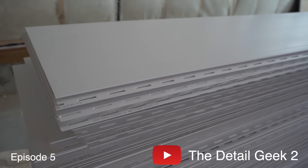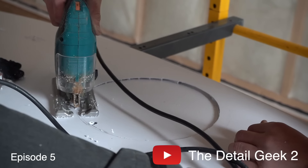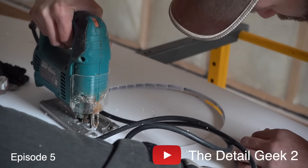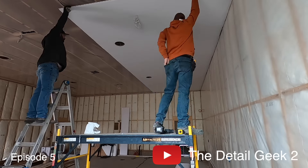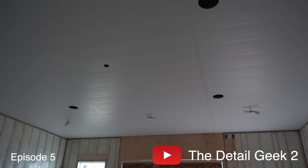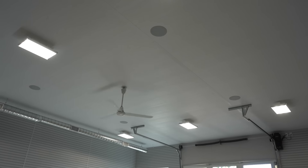While we're talking about things up on the ceiling, I almost forgot to mention what I finished the ceiling with. Up there are white PVC panels, and basically the reason I went with this instead of drywall was from the moisture standpoint — everything in the studio has been designed with moisture in mind. I wasn't really expecting to be spraying the ceiling with water, but I knew I didn't want drywall anywhere in here, and the PVC panels were just the perfect choice.